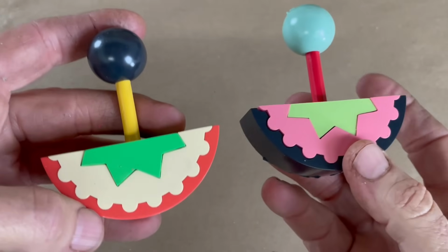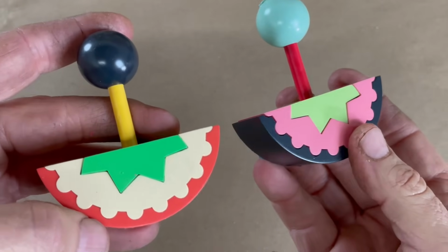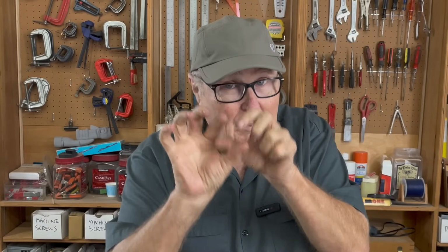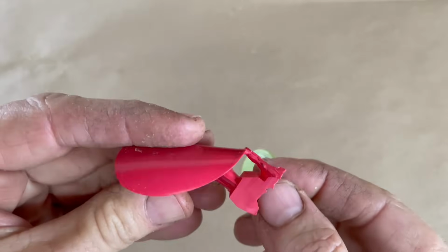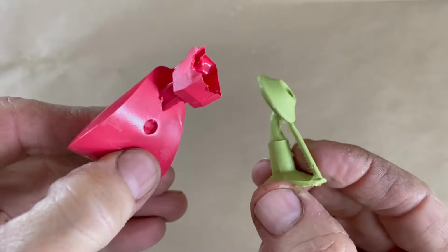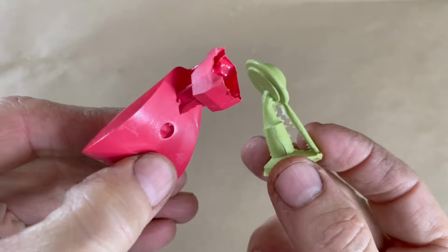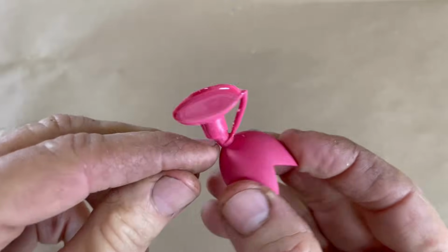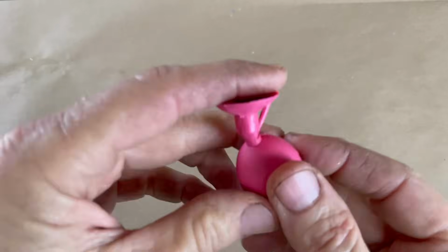But as I started to assemble the pieces, I had to become more selective. So when the parts started to come together and get completed, I was really careful about which colors were juxtaposed next to which. I wound up mixing very specific colors for very specific parts to make the final pieces look good. Once the parts were poured, it goes without saying, I had a lot of vents and sprues to cut off. Each part had its own particular design for vents and sprues, and all of them had to be cut, trimmed, sanded, polished, and put together.